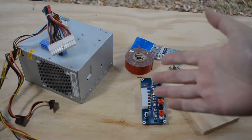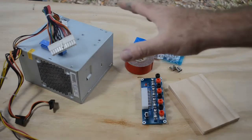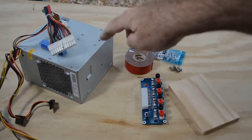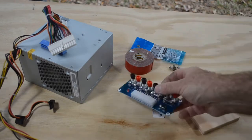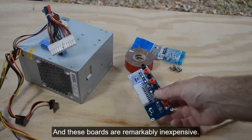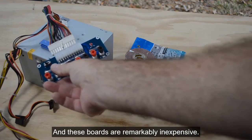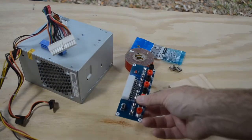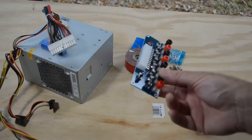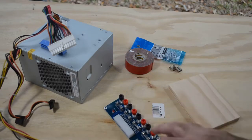Here's all the stuff you need at a minimum to build one of these in an afternoon. Used to be you had to do it all yourself — drill holes in the case, mount the banana jacks, wire them in. These days people are selling pre-made boards just for this. They'll plug right into the power connector that would normally go to the motherboard on an ATX computer, so really all you have to do is figure out a way to mount this and you've got a working benchtop power supply.